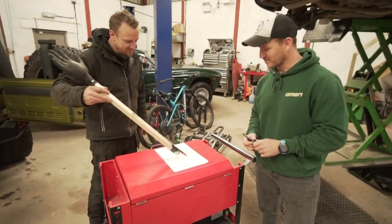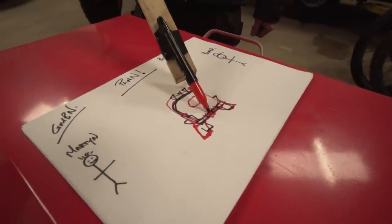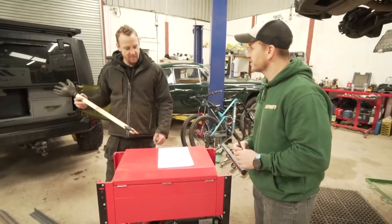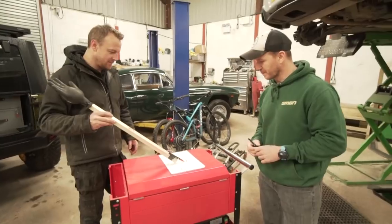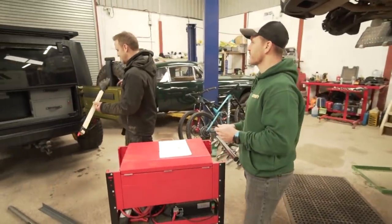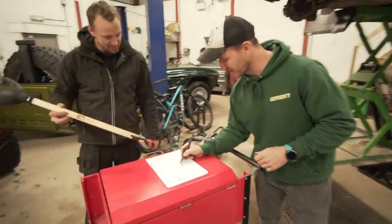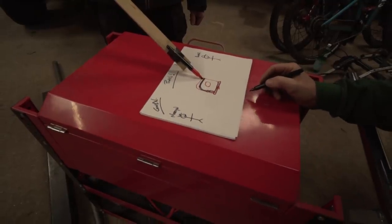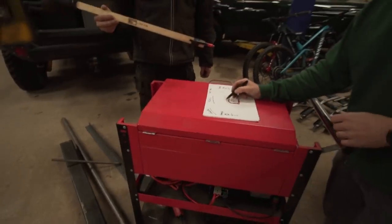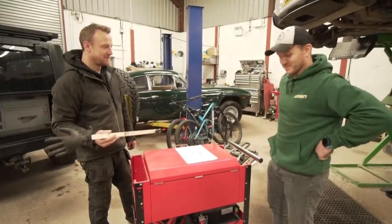So what were we thinking? We'll use the current tow bar situation, place a solid 100mm box section bar across the back, and then have a tube up here — we'll call it the tree. Then with some bending magic, the main bar comes across the top so you can swivel it out to open the back of the Jeep. The bar will come out like that, bikes out here. We'll have some sort of roof mounting to lock it in place, swivel on the tree, and baskets for each bike where the wheels sit, plus a mounting point for each rear wheel at the bottom.